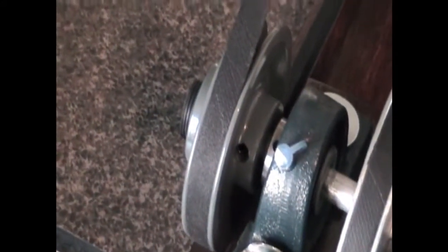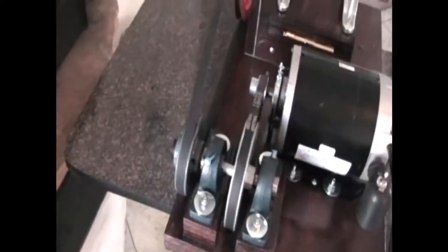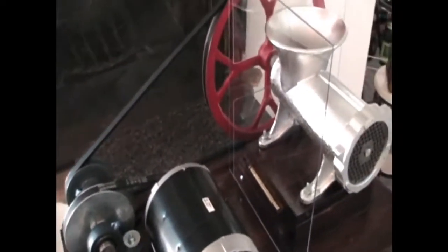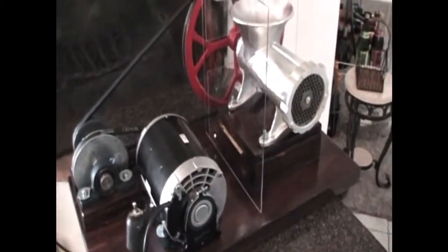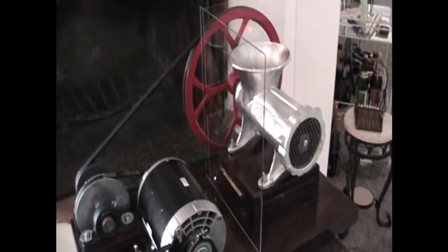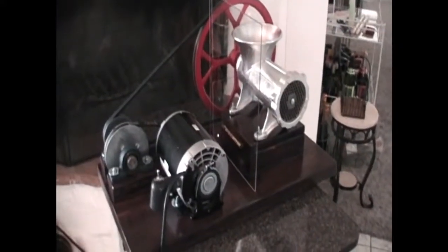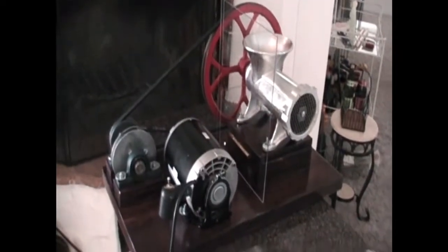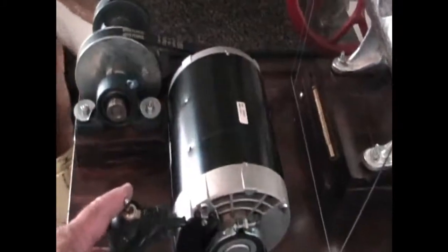In parts of this video you'll see that I originally had a one-and-a-half inch pulley instead of the three-and-three-quarter inch pulley I have now. The RPM with the one-and-a-half inch pulley was 64 revolutions per minute; now with the three-and-three-quarter inch pulley it's 161 RPM. It works a lot better — I'm very pleased with the speed. It's still slow enough to be efficient but fast enough to grind a lot of meat. I did ten pounds of pork shoulder in just over two minutes. I kept the original footage to show the difference between the 64 and 161 RPM.